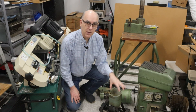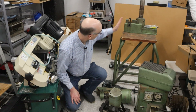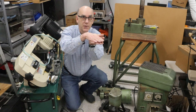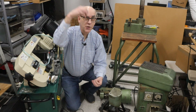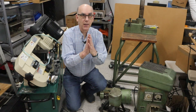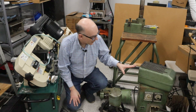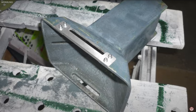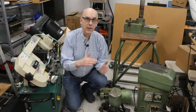This is the clamp that clamps the mold halves together. One of the interesting things about this machine is that this clamp can be put into either the vertical or the horizontal position. In the vertical position, the mold halves go like this and you can't really do fully automatic because the parts can't fall out — but you can inject through the back of the mold. In horizontal mode you are doing parting line injection, so when the mold halves separate, the part drops down. There is one feature related to fully automatic that has a chute with a sensor at the bottom to determine when the parts fall, so the cycling mechanism can ensure it doesn't cycle if the part doesn't fall out of the mold.